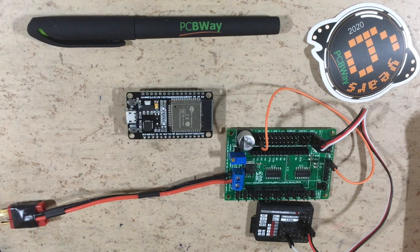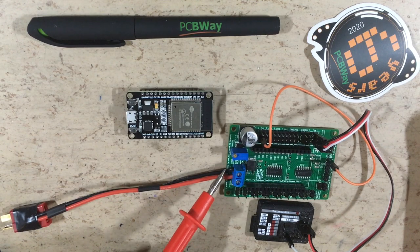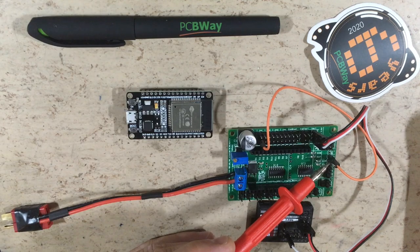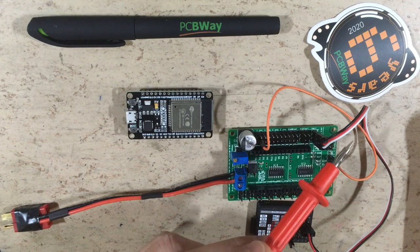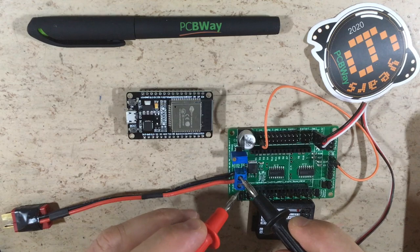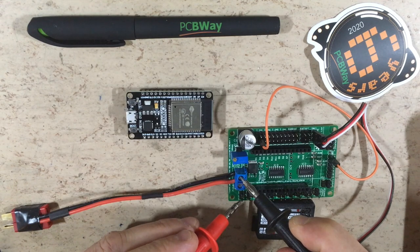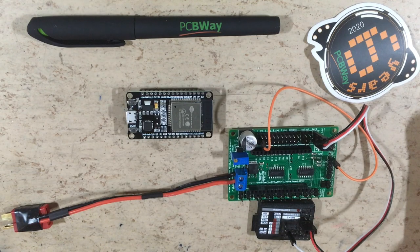Time for the first test. I have already attached a battery cable — it connects between the battery and the ESC blocks. There is no ESC connected, so we have to supply the ESP32 with this orange bridge wire. My DIY Arduino receiver is connected to the RX pin — it's controlling the sound controller via S-Bus. Before we connect the battery, we want to do some short circuit tests. Okay, no short circuit.